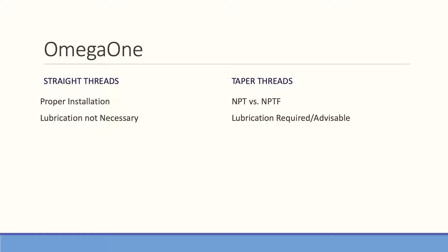The flareless fitting series, the Omega bite, has a gray moly coat on the nut, and that's designed to lubricate the threads to encourage serviceability and prevent thread galling. With pipe thread fittings, Omega One manufactures to the NPT standard. The NPT standard does naturally gall as part of its design — that's part of how it forms its seal. So lubrication is advisable. Some kind of PTFE tape or pipe dope is commonly used. It's always a good idea; it's going to extend the use of the fitting and ensure durability.